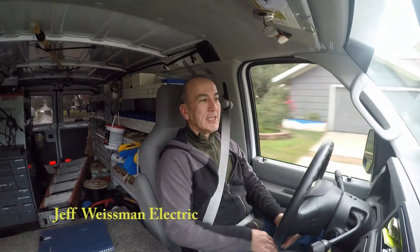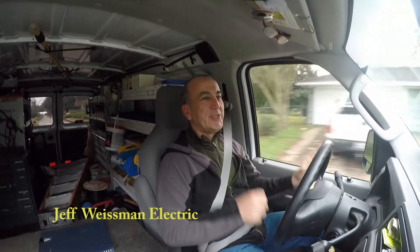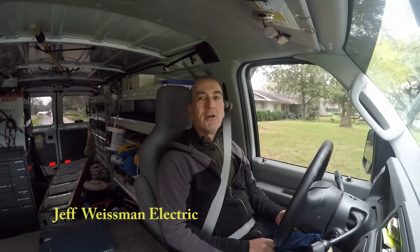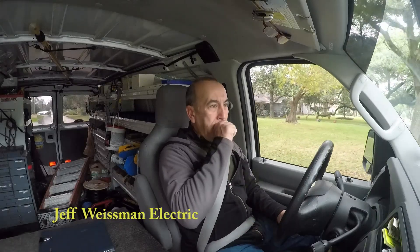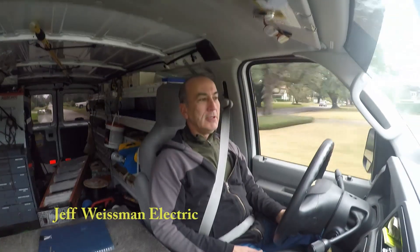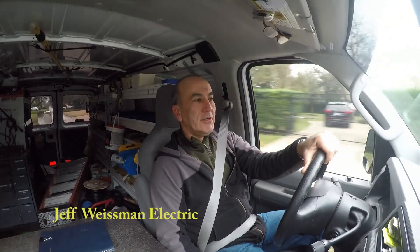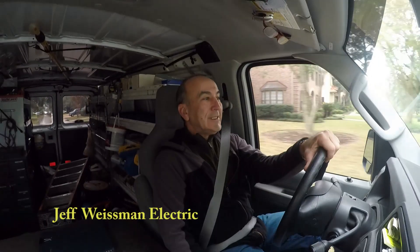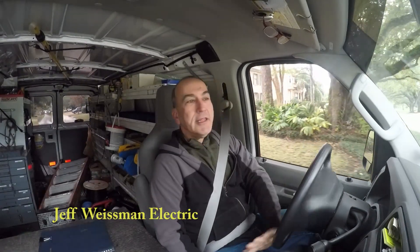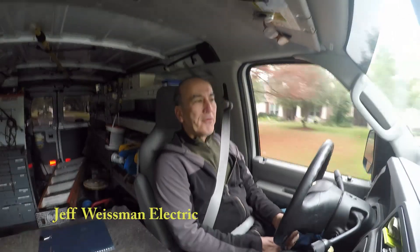in a pool holding on to an extension cord and a little bit of water getting into the bulb sockets of your Christmas lights. You could also have a frayed wire on your Christmas lights because they're old, or you could have a staple in those Christmas lights stuck into a hot conductor and into the tree. What's happening is you've got a little bit of voltage leaking, and that ground fault safety interrupter is going to trip in four one-thousandths of a second, protecting you from getting electrocuted.